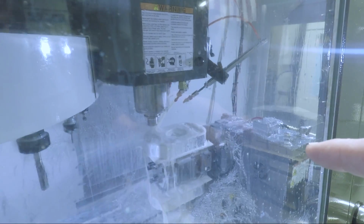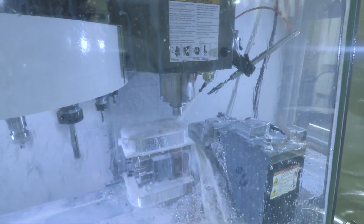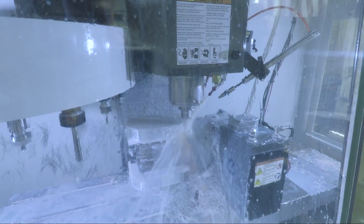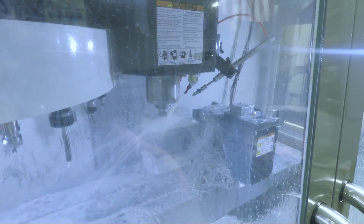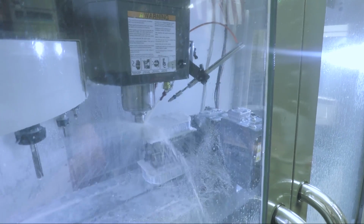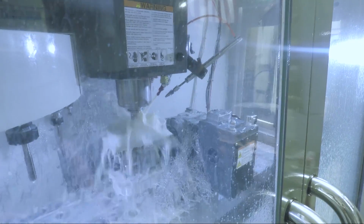Correct, yeah. What's interesting to me about this for our Tormach is not so much a need for different work holding, but rather if I can figure out a way to potentially automate these or have them run better unattended, it's going to change our Tormachs from reactionary machines, you know, when I need something done, I set it up. There's a ton of idle time on our Tormachs, and that's okay. But there's parts that we could be making for them. And again, it's this idea, if you've got pre-set up pallets and fixtures, you just go.